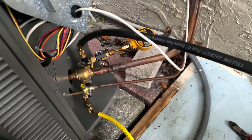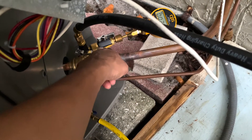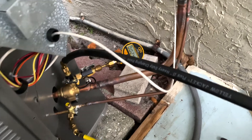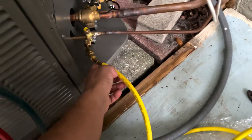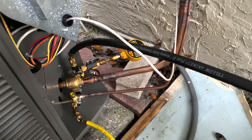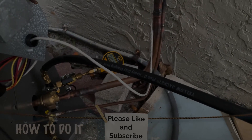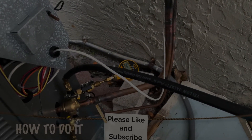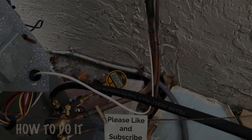I'm not going to cover releasing the pressure here, but one important thing: make sure you turn off this valve before you release any pressure into the line. You can even remove the micron gauge at this point — just make sure it's isolated so no positive pressure goes into it and damages it. Once everything is in place, close all the valves and release the pressure into the line. That's pretty much it — I just wanted to show you how to pull a proper vacuum the right way with the right equipment. If you have any questions feel free to ask below, and if you liked the video please subscribe and like. Thank you.